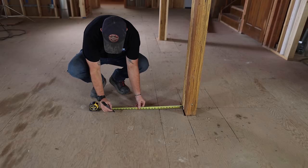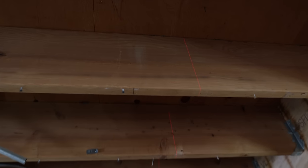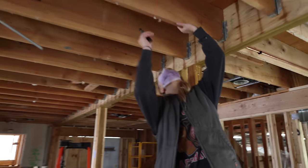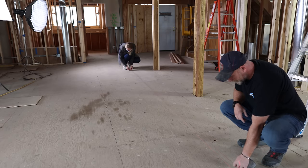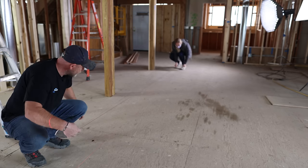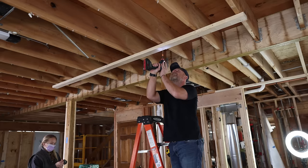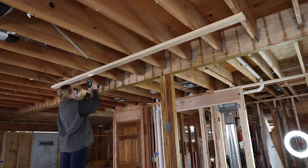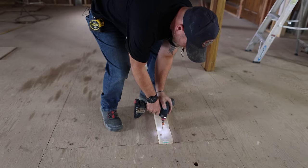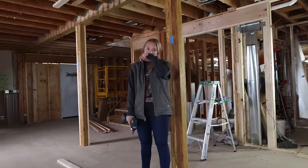We're going to pretend that those posts we have installed are a load bearing wall — the process is going to be exactly the same. After marking two feet away from our load bearing wall, we took our laser and transferred those marks to the ceiling. It's important that your top and bottom plate are perfectly in line to help transfer that load. We then installed the top plate by screwing in three-inch construction screws into every single joist, working all the way down until it was secured. For the bottom plate we did the same thing, except we placed the screws in between where the two-by-fours will be set so they are not in the way when we install them.